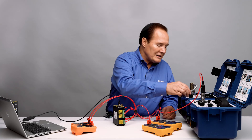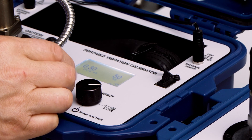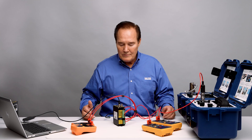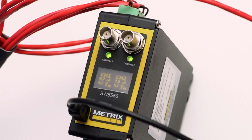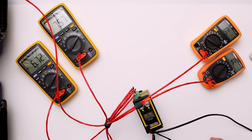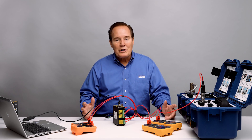Now we're going to go ahead and decrease the vibration level to 0.2 on channel two and we're going to see similar behavior — the danger will clear, and the alert will continue to flash until I hit reset. After reset is hit, you'll see that everything is back to normal: we're at normal vibration levels and everything looks good. And that's how it should work — it works the same way on an accelerometer or a proximity sensor.